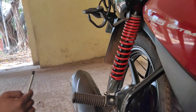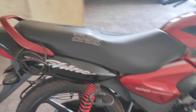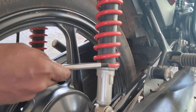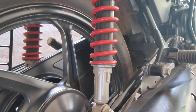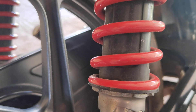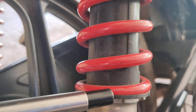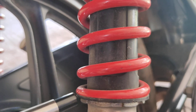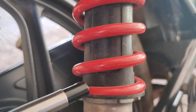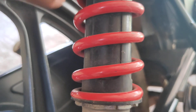Please bring the camera over here and provide a closer look of the spring. You can very clearly see that the first coil has actually been ground. This is referred to as the squared and ground end condition. You can see that the first coil hugs the end plate, and it doesn't really provide the end condition — the springy action starts from the second coil onwards.